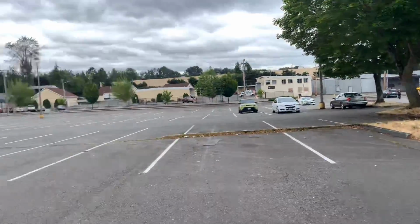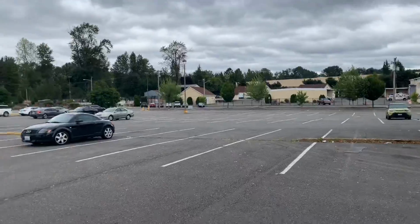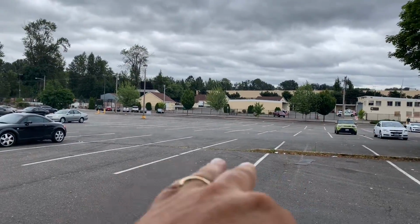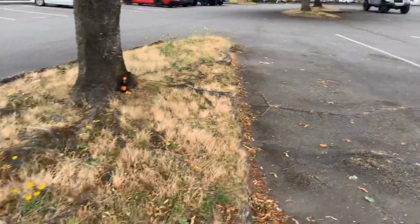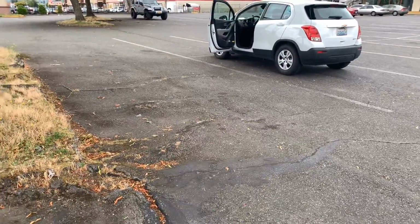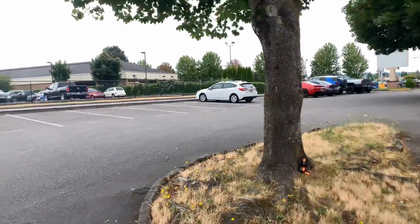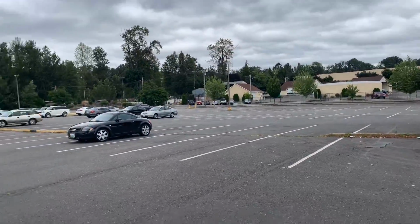Big lot. I would say power washing. There's a day of power washing for all the curbs. There's a lot of extensive cleaning. There's a lot of grass in the cracks in various areas. You've got areas like this where there's tree root damage. So that's gonna be fun to seal coat over. But you gotta clean all this stuff out. Our wire broom, the snuffy and all of that. Definitely all of that stuff will need to be brought out here.